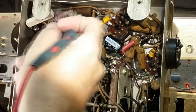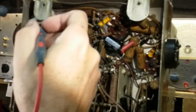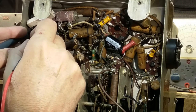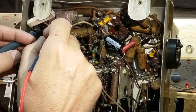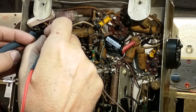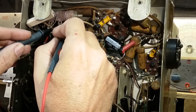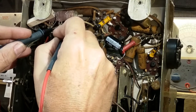First thing I want to do is check this resistive assembly and see if we've got continuity going through there. So I'm going to go across each resistor section that they put in here, and the first one is 25.8 ohms. So we need to verify what that is. This one is reading roughly 1.47 k ohms, so 1478 is what it's reading. All right, this one here is reading charging a capacitor.